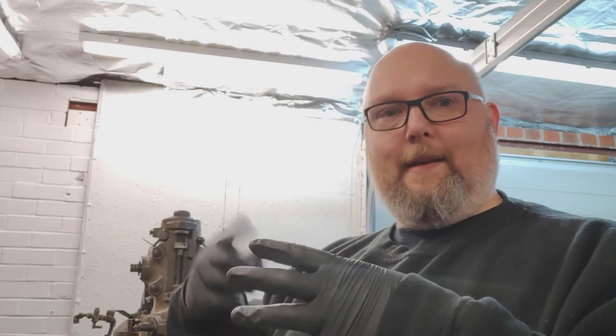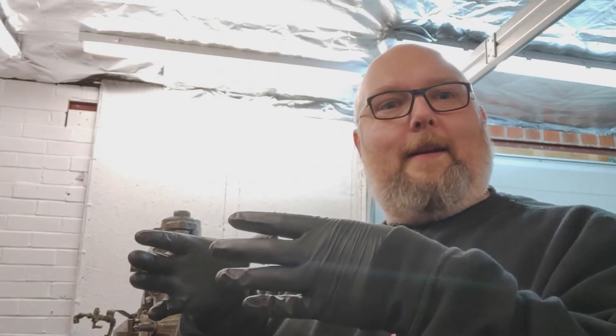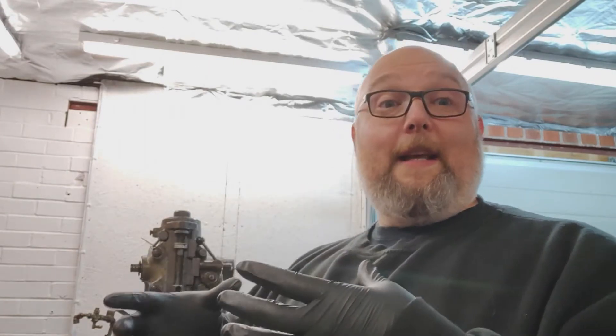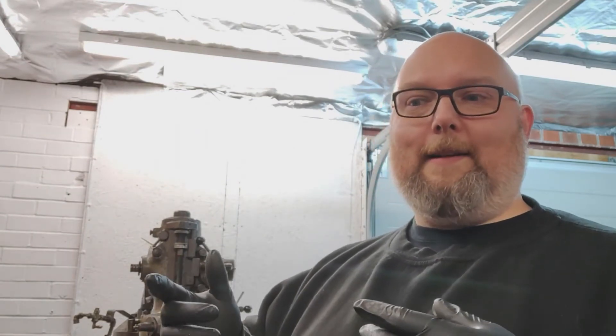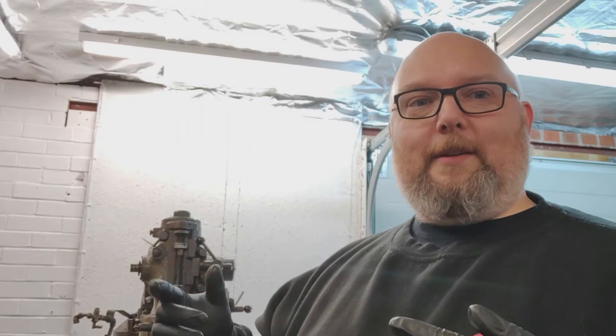The windings aren't around the middle - they're on the outside stator, I believe is the term. Now, in that other video, the guy had to go from Dahlander to delta. Dahlander is much more complicated and gives you two speeds. Perhaps I'll link some videos in the description - it's too much to go into here, and this isn't a Dahlander-wound motor.